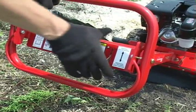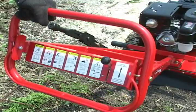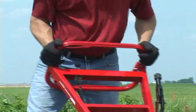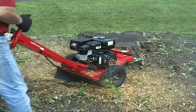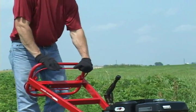You're now ready to engage the cutting blade. Do this by raising the throttle to the engaged position, and be sure to keep it fully engaged during operation. The operator presence control is the only on-off switch on the machine and must be held while operating the stump machine. If for any reason you need to stop grinding, release this control and the blade will stop spinning in a few seconds.